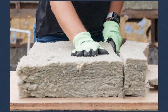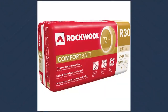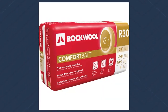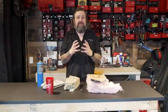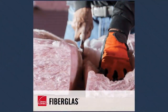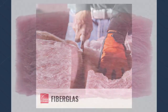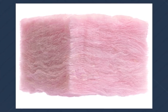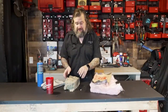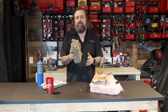And there's this newer stuff that's been out for a few years — it's a spun mineral wool made by Rockwool. Now the secret of insulation is the air that traps inside of it; that gives you the insulating value. One thing I don't like about fiberglass is you have to be really careful because you can compress it pretty easily, and the more you compress it and jam it in the wall, the less insulating value it has.